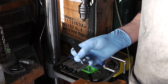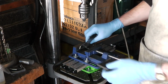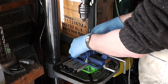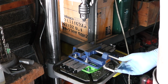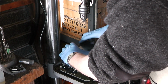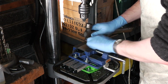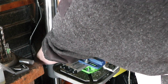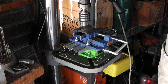1/8 times 5/8 times 6, whatever that means. They have a protective coating of grease which I will leave on them at this present moment in time. See? Now the workpiece is being held parallel, hence the name. Right, I'm just going to gently tap this so it's sitting flush. Alright, bring the table up a bit, cutting oil, and off we go. Okay, that parallel should not have been going wobble wobble.